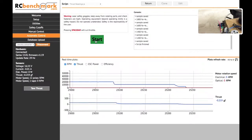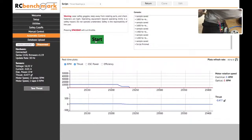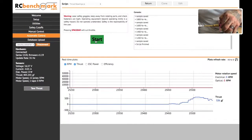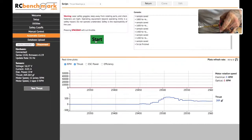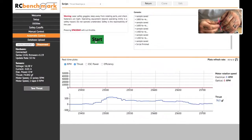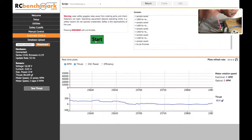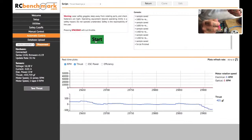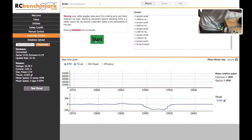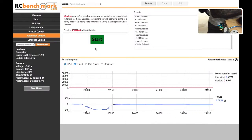I don't know if you guys saw that, but that sucker went to 573 grams of thrust, making this one so far the most powerful motor tested. With a 3x3 prop, we hit 500. Just as an example, I think the BrotherHobby hit 520, the T1. I believe the FlashHobby hit 506, and these are roundabout numbers. And the HGLRC hit up to 573. That's pretty intense.